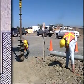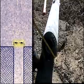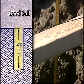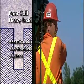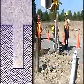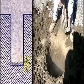After the desired pole location has been established, auger the setting hole. The hole's diameter should be 8 to 10 inches wider than the diameter of the pole butt. As for the depth, in good soil, a rule of thumb is to bury 10% of the pole length plus 2 feet. Where soil conditions are in doubt or when the pole is heavily loaded, it's recommended that a soil and structural engineer be consulted. Once the desired width and depth has been augered, an inch or so of gravel should be placed at the bottom of the hole for leveling purposes and to provide a firm footing.